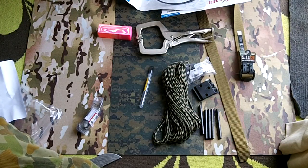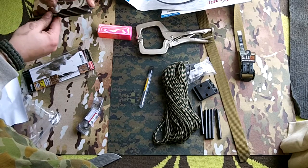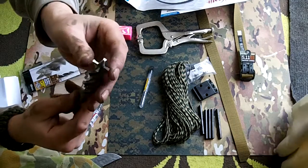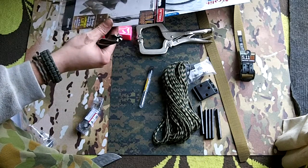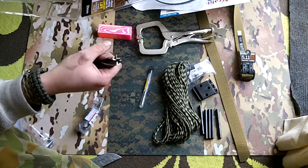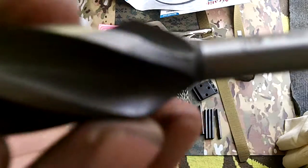When you're drilling through carbon fiber and G10, it's not very easy. I used what's called a wood beaver — all I did was modify the screw on the end so it didn't have as much pull, and that goes through G10 and carbon fiber like cheese. Then they brought a new one out and I needed to replace mine anyway. This is a bi-metal one — it's made for cutting through wood with nails in it. Well, cutting through G10 and carbon fiber is probably not that much different, so in theory that should last me quite a long time.